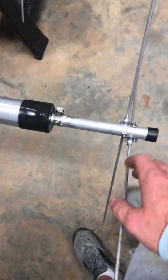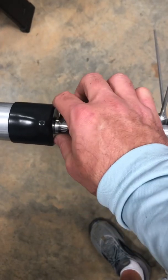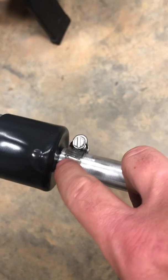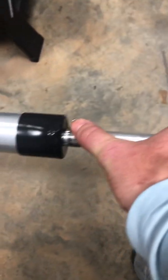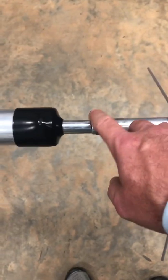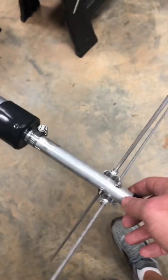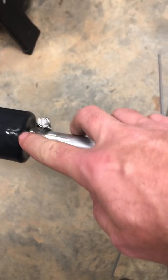Another problem I faced was Element 1 and tuning it. This piece needs to be 7 inches from here to the end of the cap, but you really have to fight the boot because it wants to come out. On Element 1, the overall length is 7 inches, so you have to push and fight the boot in to get your 7-inch measurement. Element 3 is 9 inches from here to your end cap — that's not a big deal, just measure it out, mark it with a Sharpie. But on Element 1, I was originally only getting about 7.5 to 7.25 inches, so you have to really tuck the boot in hard and push it on firmly to achieve your 7 inches.